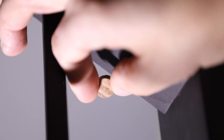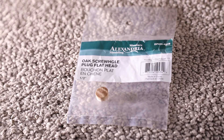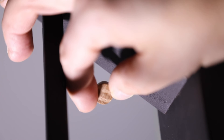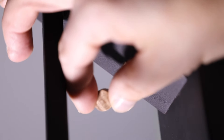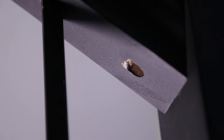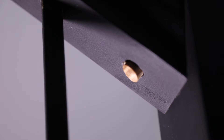Here's what the plugs look like that go inside those holes to cover the screws. This is an oak screw hole plug — a flat head plug, half-inch size. You can get them on Amazon, and I'll put the link in the description. When you're going to paint, you screw it all back together, still have the hole, so you take these oak plugs, put them in the hole, and pound them in with a hammer or dead blow. Then I put a little wood filler on top, sanded it down, and you can paint it.